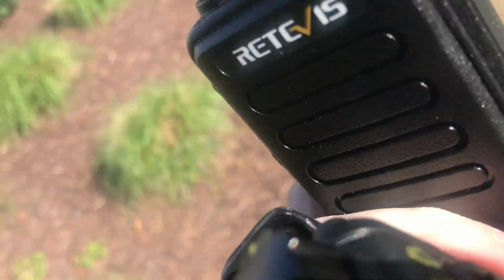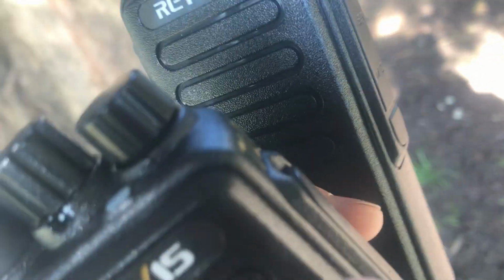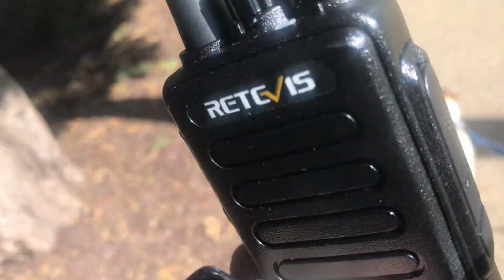And then there's encryption that is run on DMR digital voice, which is just the same thing. If you run encryption on another digital system, you are simply encrypting the data packets and then decrypting them on the other end. The same applies for a vocoded voice signal that's been converted to data: encrypted, transmitted, received, decrypted, and then converted back into voice by the vocoder's decoder part on the radio receiver, whatever digital voice mode you're using, DMR, NXDN, P25, Tetra, what have you. So it's the same concept.